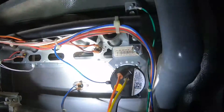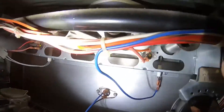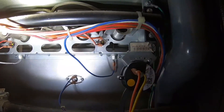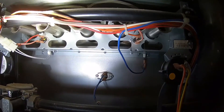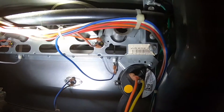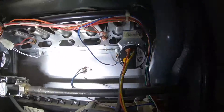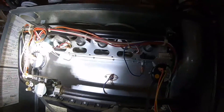This was the sixth blinking light — the little red light on the board right there, blinking six times in a row. Now we know that fuse right there and that fuse right there — the two open rollout fuses — just press them. Man, that's all it was! I hope this helps someone out. Those two open rollout fuses there, and there was that other fuse up here with a button as well. That's what it ended up being — that's crazy.